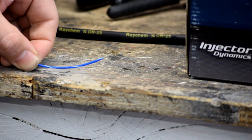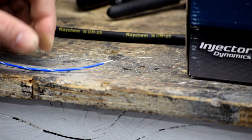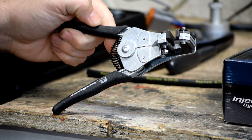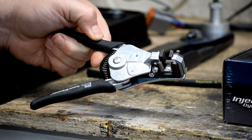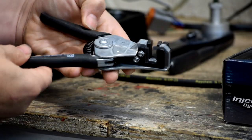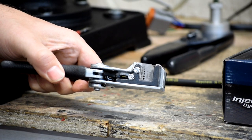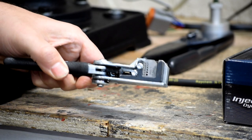It's not that much more expensive than regular wire — a little more pricey, but not ridiculously so. The biggest problem with Tefzel is that it is a pain to strip. It requires its own proprietary stripper. The insulation is very slippery and very thin — very difficult to strip with a standard hardware store wire stripper. It takes a proprietary stripper to cut it properly. This stripper has a jaw with little dimples precisely sized to cut the insulation on this particular kind of wire.